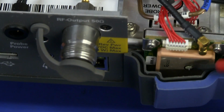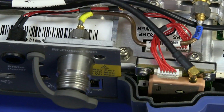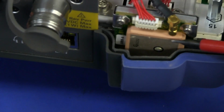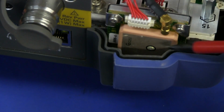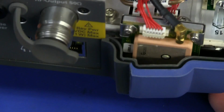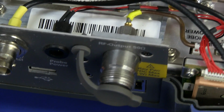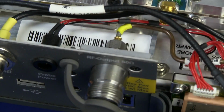So it looks like they've got an internal patch antenna and then an optional external antenna as well. So it will work with the internal antenna. You can see it's a patch antenna due to that center point, and then the antenna pad on the top there. So, a typical patch antenna. Their performance isn't that great, but certainly adequate for getting something out of the thing anyway. So there's our GPS antenna, and it goes around to the external trigger.